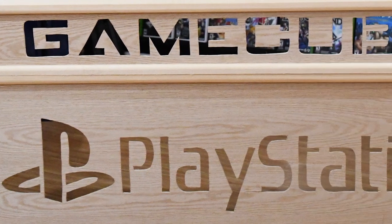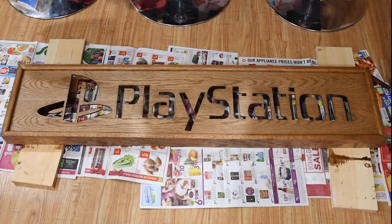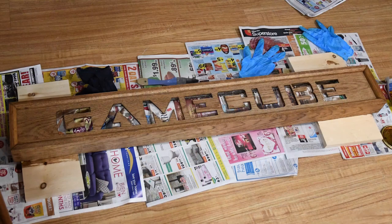Then we stained it. Staining didn't take too long but it was mega stinky, and we had to let it dry overnight. I would suggest doing that in a well-ventilated area. The next morning it was all dry and I decided to put plexiglass in. I cut it on the table saw, placed it in, and used clear silicone to glue it. The LED lights came with little clips you can screw into the wood to hold everything, so I used those to install the lights on the inside. I cut a notch in the top of the sign where I wanted the plug to come out and go up into the ceiling, and then hung the signs.